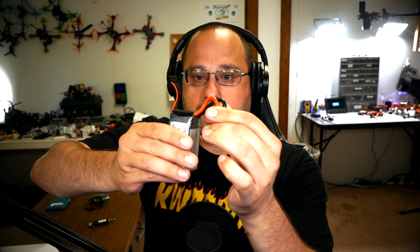So I'm not sure how much faith we should put in that, because when you measure continuity, what the multimeter is going to do is push a very, very weak current from one probe. And if that current or voltage is detected at the other probe, then it says continuity's there. The problem is that you're not supposed to do continuity measurements on an energized circuit because they may produce inconsistent results. I've never done a continuity measurement on a battery, but if there was a short somewhere in the battery between the positive and the negative, what would the battery do?